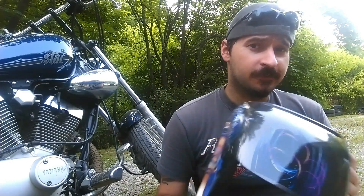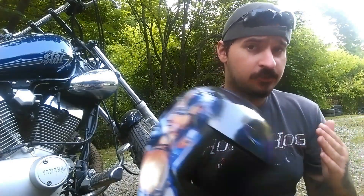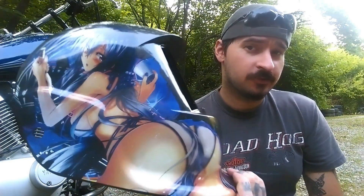That was a pretty good angle I guess, but anyway the helmet basically — you can see a thin coat of clear coat over it. It's basically a sticker and it's super thin, hardly any clear coat over it. So what I'm going to do — I actually want this helmet to last — is teach you how to re-clear your welding helmet if you buy one of these cheap ones, give it more durability and better shine. The first thing you want to do is get your helmet prepped. You will need a red scotch brite; you can use sandpaper 400 to 320. I recommend 400.